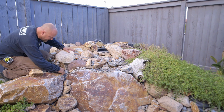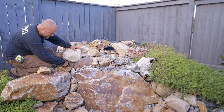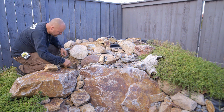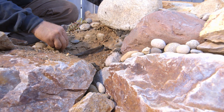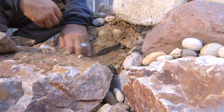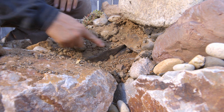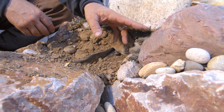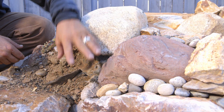It's a really close call here — there's a wicking effect where dirt is all the way down to the liner touching the foam. There's capillary action happening where the liner's edge is right here; the dirt acts as a sponge and starts to suck the water out. This piece of liner is cut too short. If any water moves through here, the area would certainly become saturated — that's why the foaming looks like an afterthought repair to push water the other way.